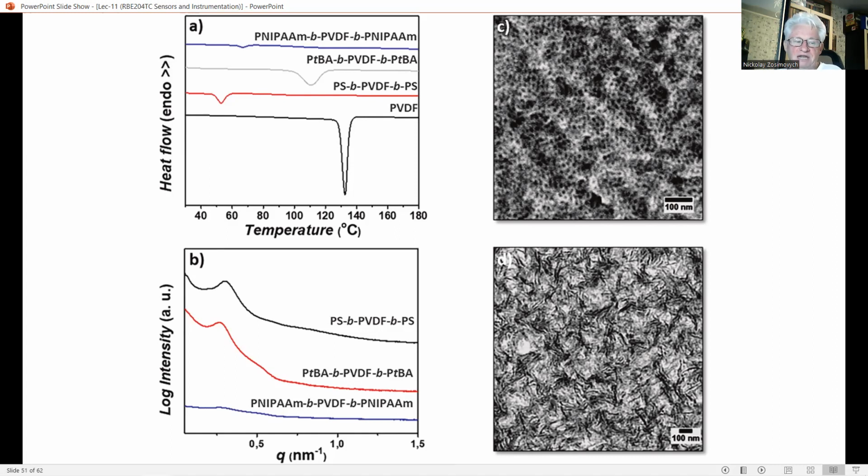More recently, piezoelectric copolymers of PVDF, for instance, VDF and TrFE, have been developed, and this material is available as a solution. It can be deposited on the wafers by spinning. Polymer on silicon technology opens up the possibility for the creation of smart or integrated sensing devices for the detection of pressure, force, sound, and thermal energy. The latter due to the fact that PVDF is pyroelectric as well.